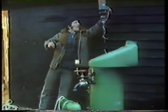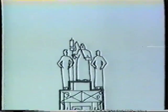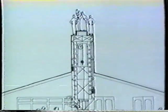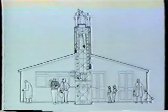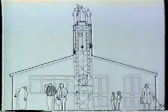Because it's a gas boiler, it'll have to be lit every morning and shut down at night. It'll also need flushing out at least once a week, and the mechanical parts will need regular oiling — much more so than the water clock. The whistle will be supported at the top of the clock, held by the central statue. People can read the time by the position of the weights down the side of the tower. The fall of the minute weight on the right is controlled by the pendulum, and the weight is wound each hour by the steam engine, which also moves the hour weight on the left down one division and moves the figures at the top.